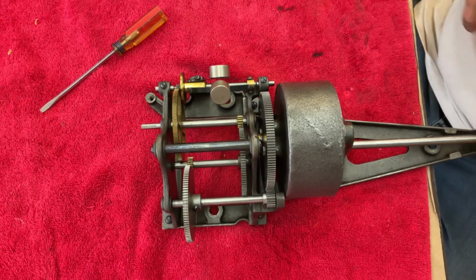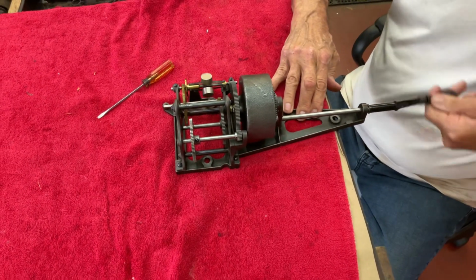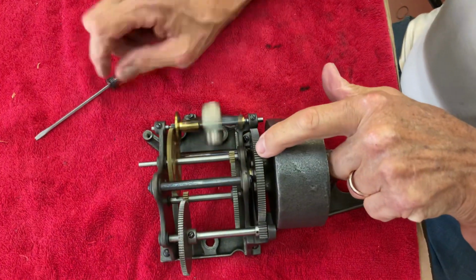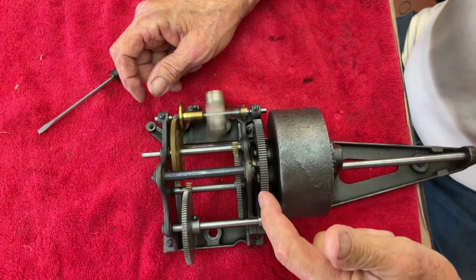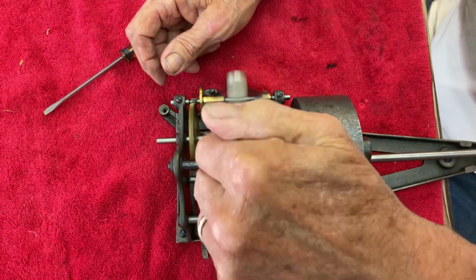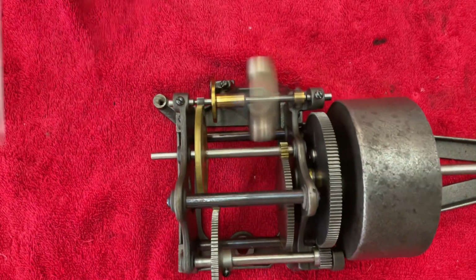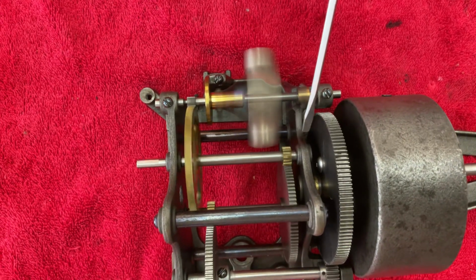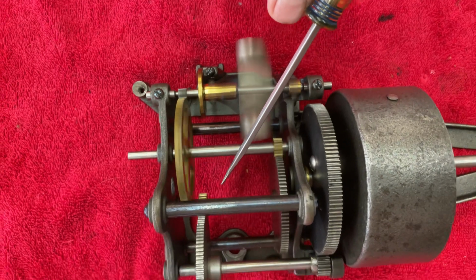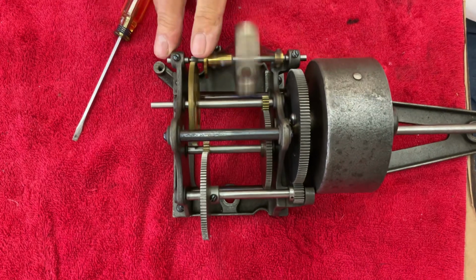So if you crank the phonograph up, well, let's just turn this on because I can show you. We'll wind this up a little, get it to run. Oh, it's alive. This gear is driving in here like this, which is spinning this gear train one, rotating this way counterclockwise. And you can see that brass gear running here, but all the power is in this bottom one down here. And those usually fail over 100 years. You can slow this down a little.